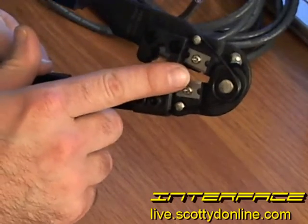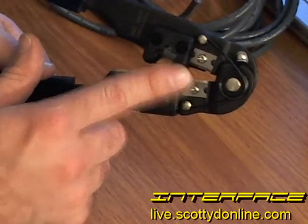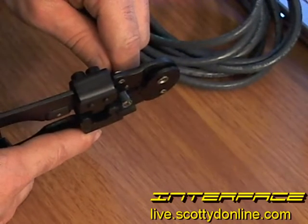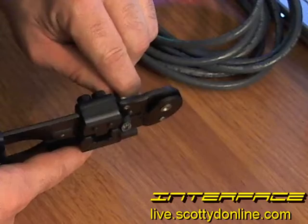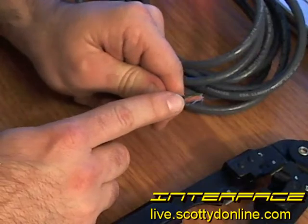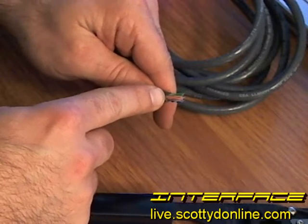What the tool doesn't have is insurance against cutting too deep, so when stripping the outside insulation you need to be very careful. Take the Ethernet cable and insert it into the front all the way to the metal stop. Very carefully squeeze as it just cuts through the insulation, then let go to get a clean ring all the way around. Remove the sheathing to expose all of the internal coppers, then inspect them to make sure the blades didn't cut too deep and damage any inside cables.